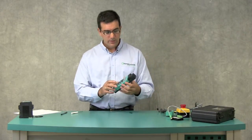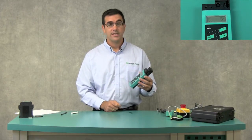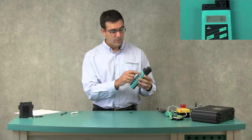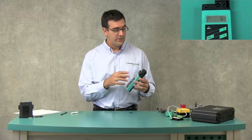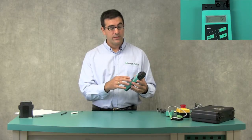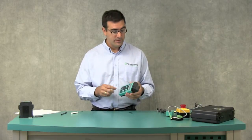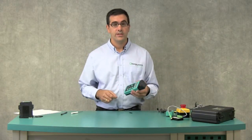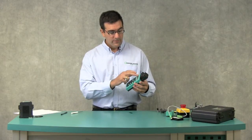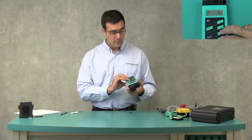What you'll notice also, as you program the addresses, is that at the bottom there's a little address list. It'll show you addresses 1 to 31, 1 to 31A, and 1 to 31B — all the addresses that you've programmed previously. The idea is that if you keep track of the nodes you've programmed, you won't accidentally make a duplicate. Keep in mind, it will not prevent you from programming the same address twice, just in case you're doing two machines simultaneously. If you want to clear this list to start over, just press and hold both buttons down simultaneously.